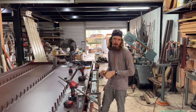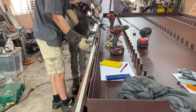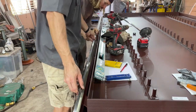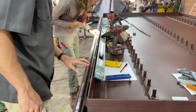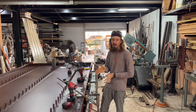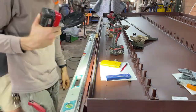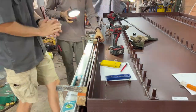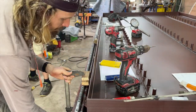Hopefully the level gets us closer. We're drilling segments of holes and then staggering — moving the linear rail about halfway down or a little more, then dropping in a few bolts so that the pins are facing the same direction. That way it doesn't matter how you orient the linear rail. We're re-adjusting, making sure everything is as straight as possible, drilling, and doing that the whole way across — double-checking ourselves a lot — then doing the same thing on the other side.